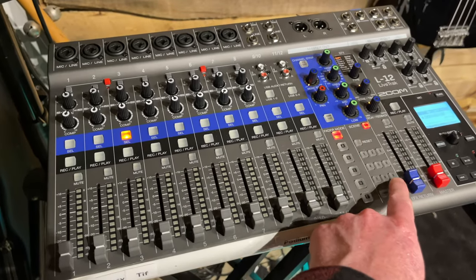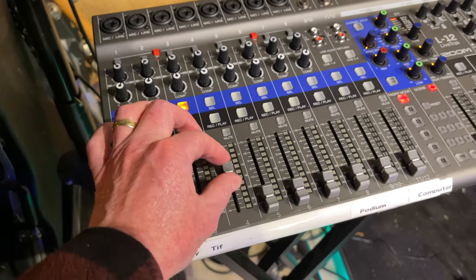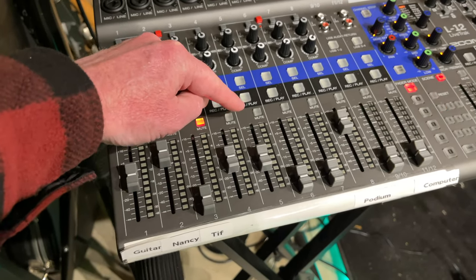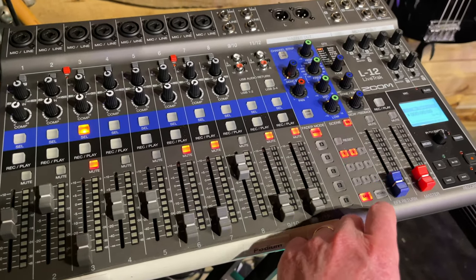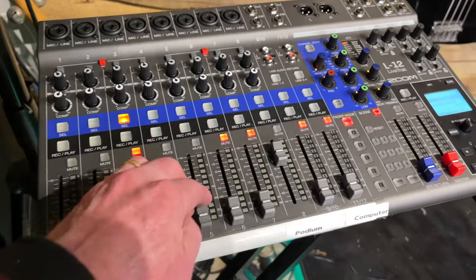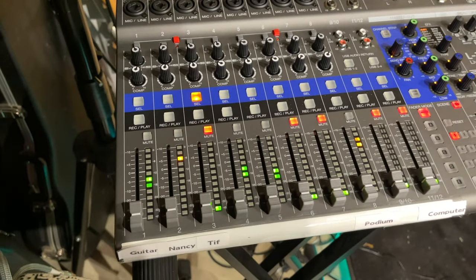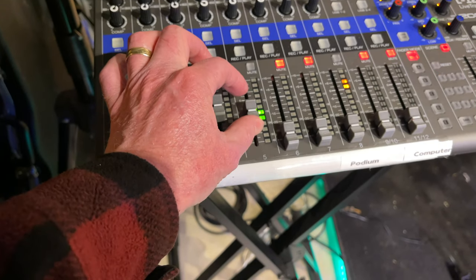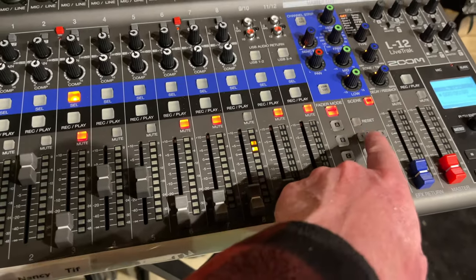Here's how to save a scene. There are nine different banks to save scenes in — I'm just using one and two right now. I'm going to overwrite number one, so I'll set this up the way I like it — way up on the podium, adjusting volume levels for each individual track, then muting some channels. I do save and pick a bank — I'll pick one. Now if I want to recall that, I do recall and one, and all the lights go back to where I had them, including the mutes. So if you have a setting you typically like to start with, put the sliders where you want and the mutes where you want, do save, pick a bank, and you're all set.